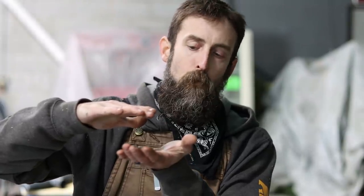Now, when we bought this place, I went up in the attic and down in the crawl space, and I fluffed up all the insulation because my house is relatively old, and all that fiberglass insulation in the attic had crept and got thinner and thinner. It probably was 4 inches thick or less in the attic, when it should have been 6 or 8. And it had lost a lot of its insulating capabilities, not to mention rodents and mice had built in it, and it's just a perfect environment for those guys. And if you live anywhere near a rural area, you've got mice. You may not have them in your living space, but they're probably very well established in your walls and in your attic. At least that's my experience anyway.